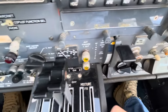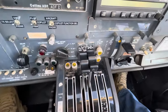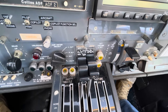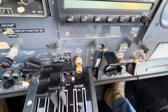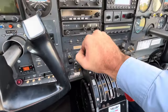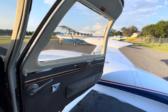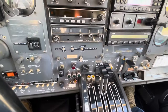With the battery master on you can hear the transfer pumps running. When the nacelle tank is exhausted, indicator lights attached to sensors detect the drop in fuel pressure and illuminate, telling us to turn the transfer pumps off — those pumps are lubricated by the fuel itself, so running them dry just wears them out. It takes about an hour to transfer the nacelle fuel, so as you approach that point you need to consciously watch for those lights, as glare can make them difficult to see.